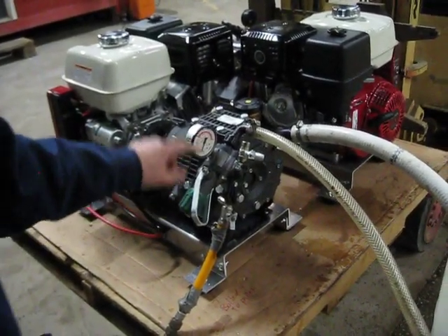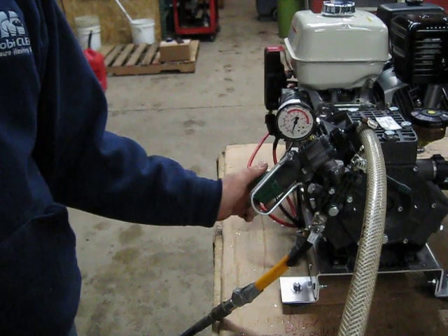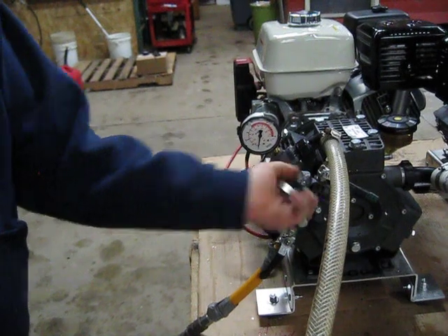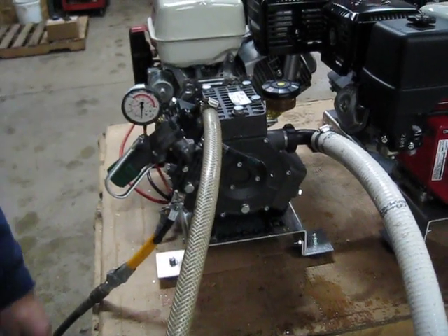Okay, as you can see we adjusted the pressure — we were operating at about 300 psi. It actually works a little better sometimes at a lower pressure than a higher pressure. And you saw how the knob allows you to send more water into bypass or less water into bypass, and it would work the same on both guns.